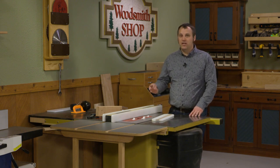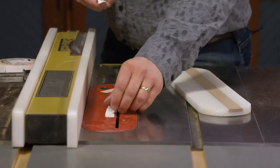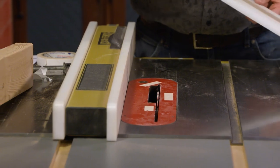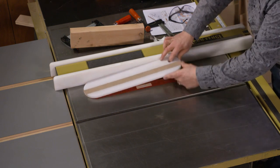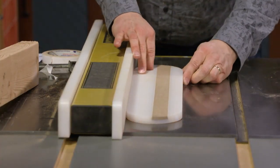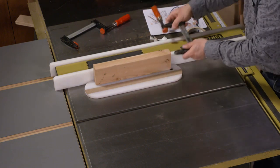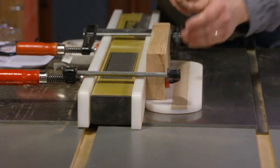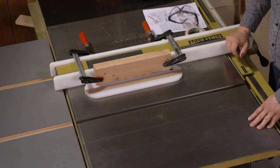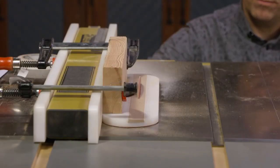What we want to do now is cut a kerf through the bottom and into the strip. Now on a lot of table saws, this one included, you can't lower the blade far enough to drop the insert in place. So I'm going to attach my new insert to the old one using a few pieces of double-sided tape. I've aligned the rip fence to the edge of the insert to give me a better chance at getting everything lined up. Make sure the blade is as low as it can go. For an extra measure of safety, I'm going to use a piece of 2x4 and clamp that to the rip fence. I've located the clamps so they're going to be out of the path of the blade. As I turn on the blade and raise it up through the insert, the insert might lift slightly because the rip fence isn't clamped at the far end — not a big deal, and once the blade comes through, everything will settle back right where it should.